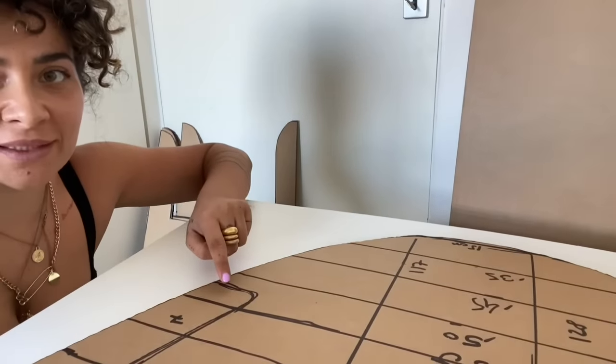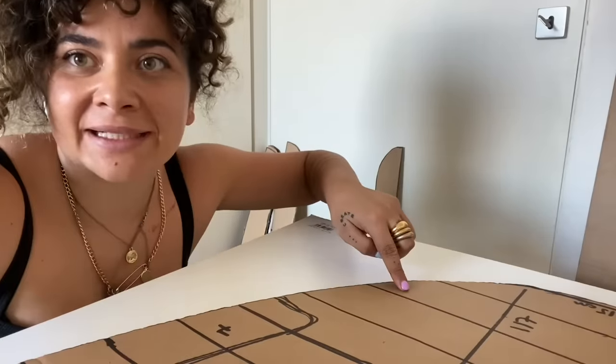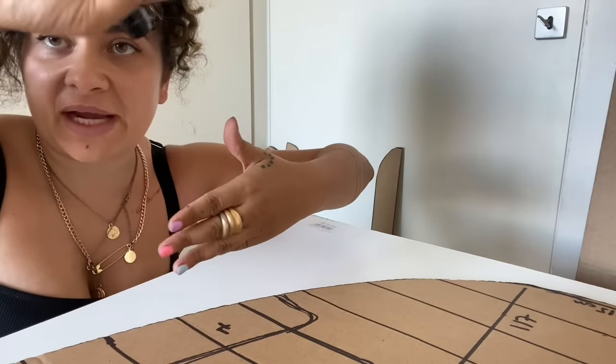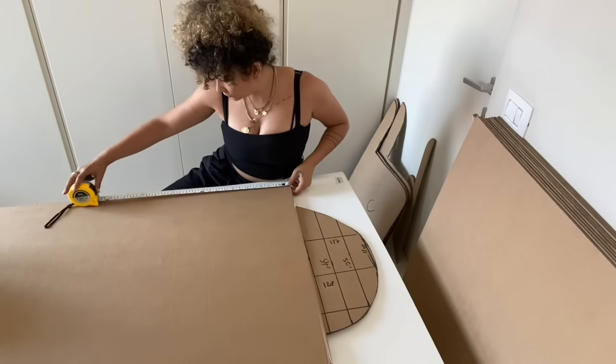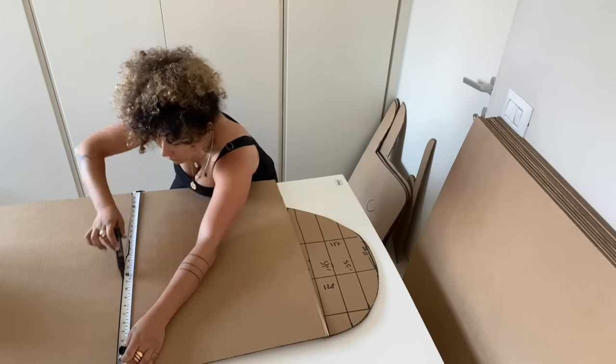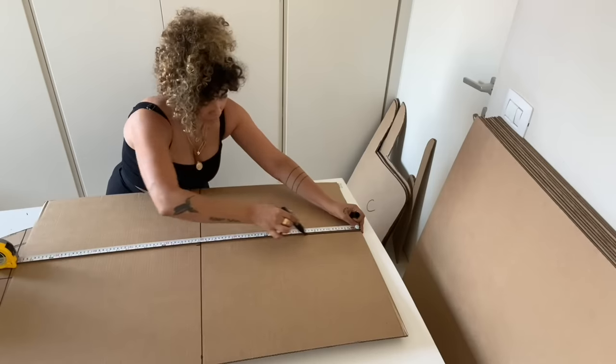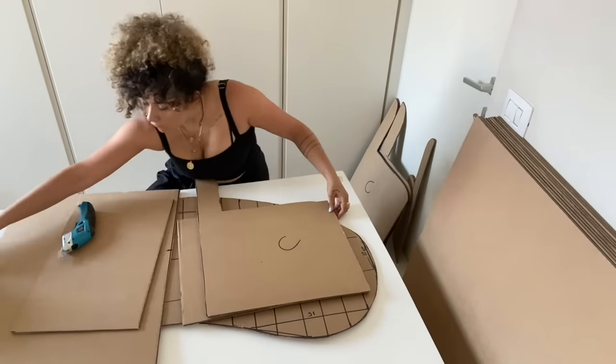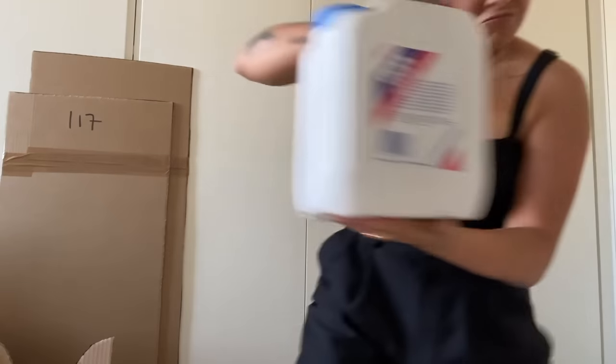Just to avoid mistakes - in the area with the back seat, after the curve, all the lines mean the entire depth. So here for example it's 45 centimeters - I'm going to do a 45 centimeter section and not a back seat area, going straight. Same identical technique but without the back: measuring the height, measuring the depth, and not adding the back curve. I take out piece C again just to position it on top and make sure the curve of the end of the couch is identical so the shape is maintained. Then we take out the glue.